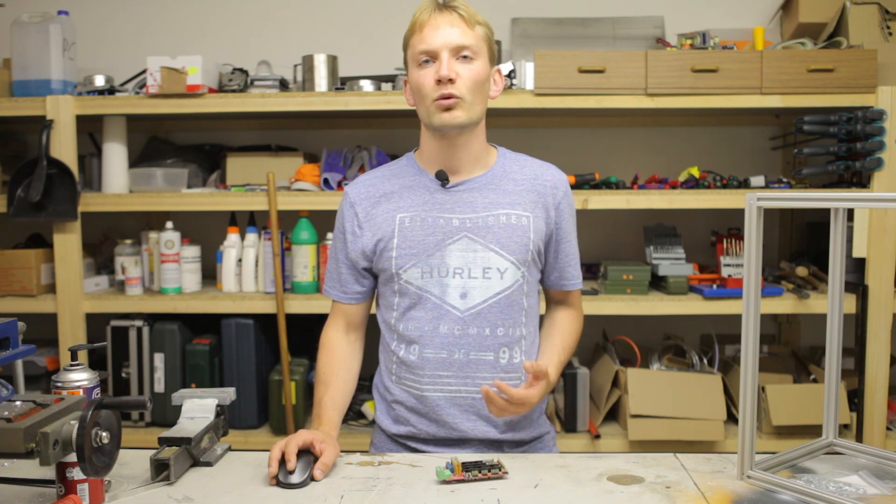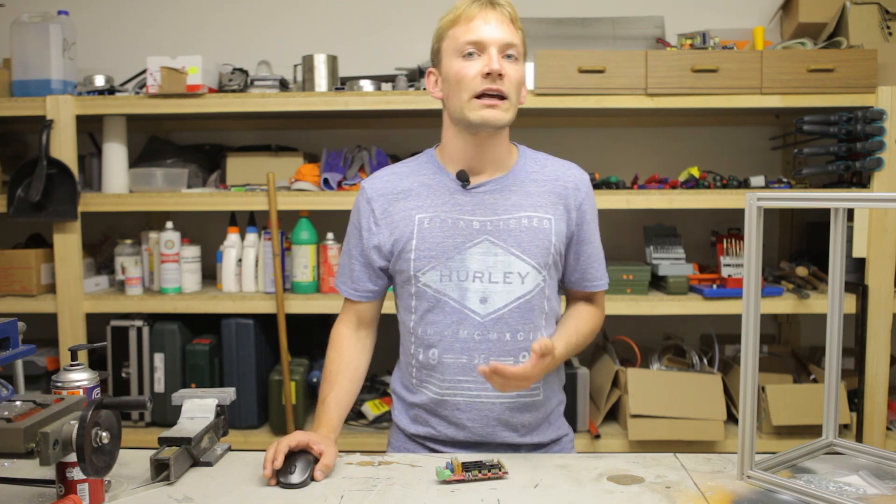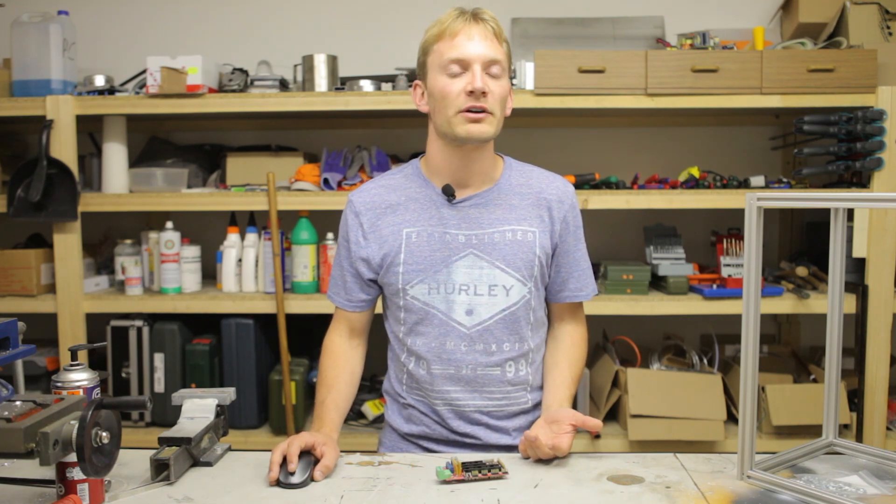Fans and so on if you add a simple driver transistor for those. And if you know your way around the firmware, you can even use these expansion headers to add more motor drivers or heaters and, for example, expand the RAMPS to basically as many extruders as you want. The only thing that's limiting your imagination here is the memory of the Arduino.